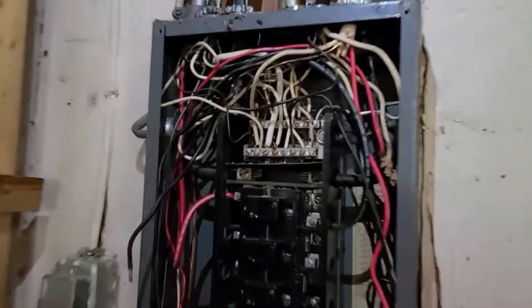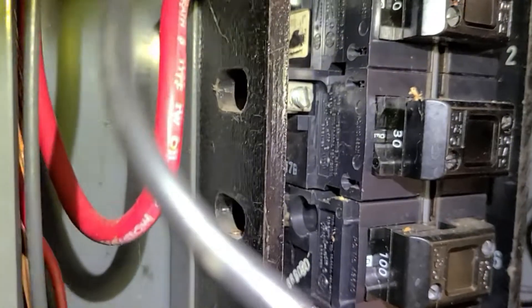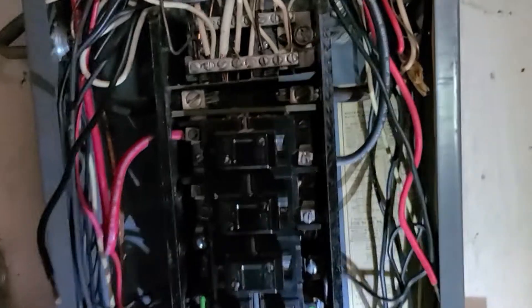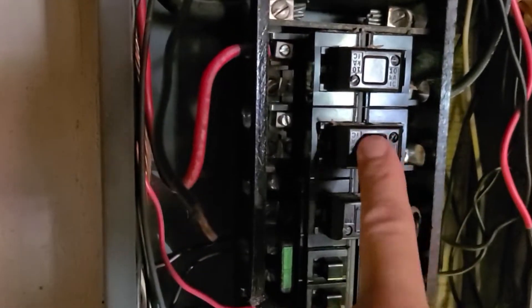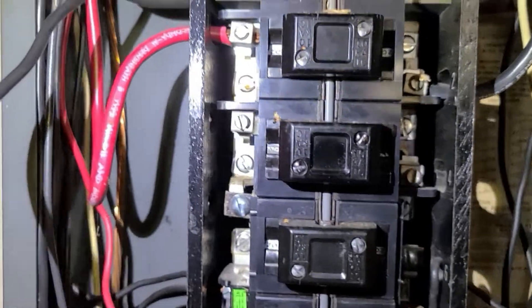Here's where the wire is coming into the house. I need to run it all the way along this drop ceiling — it's a straight run — and drop it down here into the box. It ended up connecting to this breaker here, but this breaker is too big for what we're doing. It is a 30 amp breaker, and we need a 20 amp breaker because we are running 16 amps. We're not going to draw anything more than 16 amps, so we'll be okay for the wire. But I'm going to do some research and see if I can find a 20 amp replacement, because it doesn't seem hard to swap out.